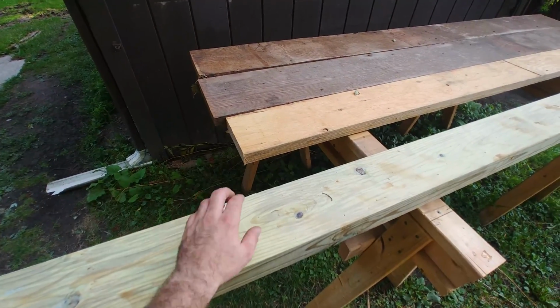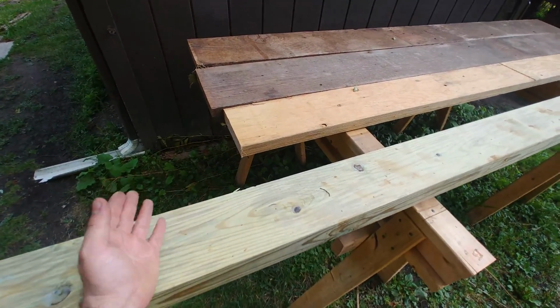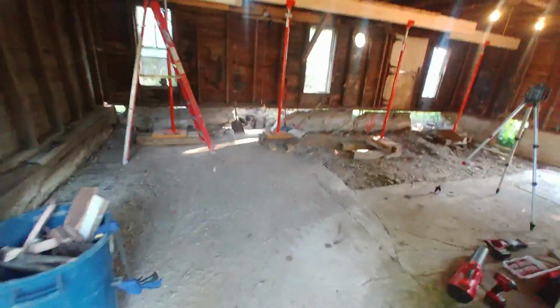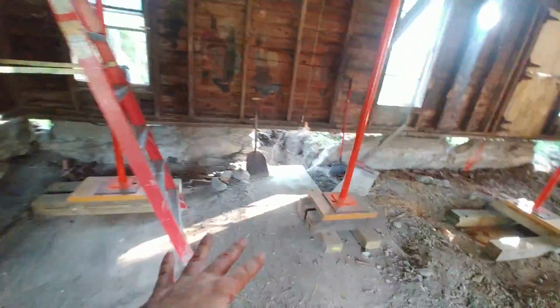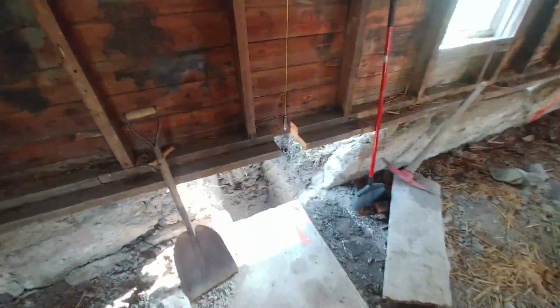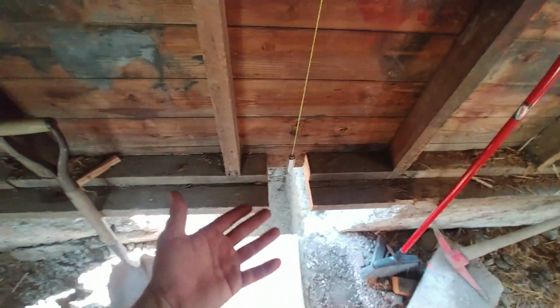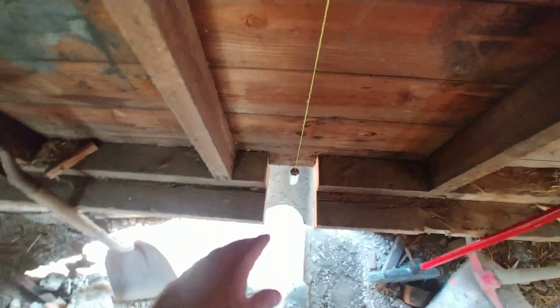because putting the weight onto this fresh timber, all the different things, the timber's overall length being wet could lose a 1/16 of an inch from the weight. That footing could press down into the ground 1/8 of an inch from the weight, and we want to be back. Whatever it is that you do, you want to do it everywhere. So I have to come up with a convention. Maybe I'll do nothing. The most important thing is that you do it the same to every post. So maybe I'll make the measurement from concrete to bottom surface of steel bracket.